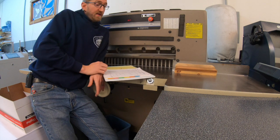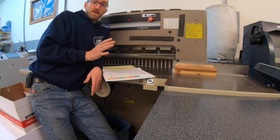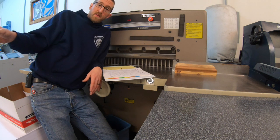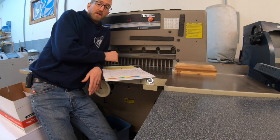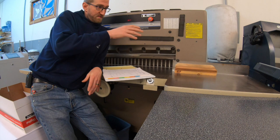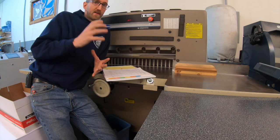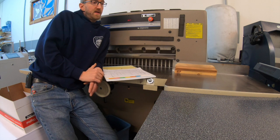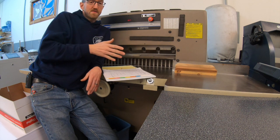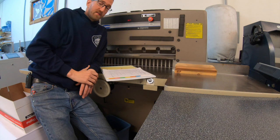I really try to stretch out knife changes. Notice the cutter is right next to the perfect binder — that's on purpose. As soon as book blocks get cut down, they go right into the binder with no carrying needed. Originally our old perfect binder was across the room, so we'd cut book blocks, carry them over to bind, carry them back, then trim. That was before we had the three-knife trimmer. One straight line: one guy can print, cut, bind, and trim — depending on page count, probably a thousand books a day out of this setup.